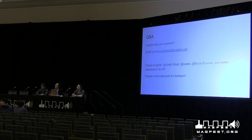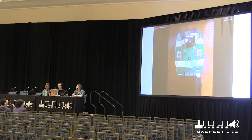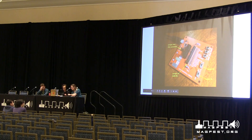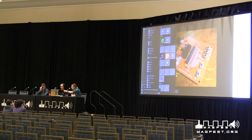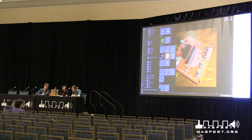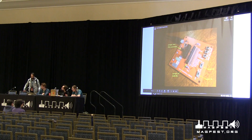Q: Can we see the video about testing your hardware? We'll just run it. This is the programmer and how you set it up. There are a couple of switches useful for development, but if you're programming, you want it on 5 volts with a jumper between ground and SCL, which forces the swadge to boot into programming mode. We also had a Python GUI to do the programming — just a laptop, make sure your swadge is running on USB power, plug it in, the LEDs flash disco for about 10 seconds, and you get a green notification. Then we had test mode firmware: a little spinning banana to prove the OLED was working, LEDs going around in a circle, playing Black Dog by Led Zeppelin, displaying accelerometer data on screen. Assembly workers would plug them in, press some buttons, give it a tilt, and throw it in another box — guaranteeing we get 3,000 working swadges rather than 2,500 working ones and 500 busted ones.